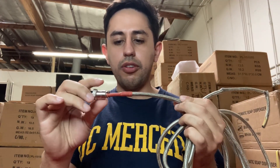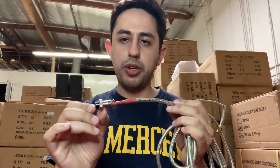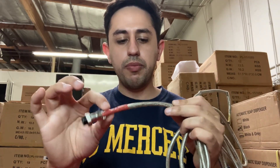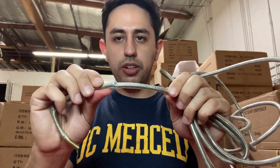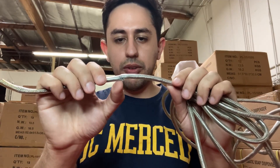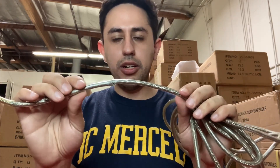First, check your cable. A lot of times these 5 pins can be yanked out and the cables will be sticking out. This will often break the solder points, and if this cable is damaged, that weigh pad will never weigh properly. So make sure the cable on the 5-pin end isn't yanked out in any way, and run your hands through the cable. You will notice a smushed spot where a weight or vehicle wheels ran over it. With this damage, it will not accurately weigh and will give an error, so the cable will have to be replaced with this weigh pad or axle scale.